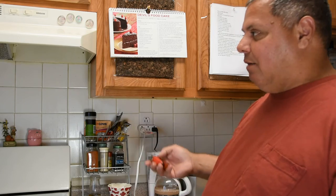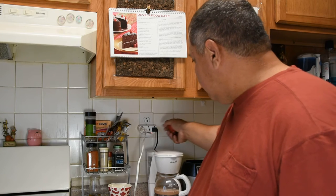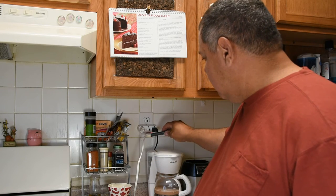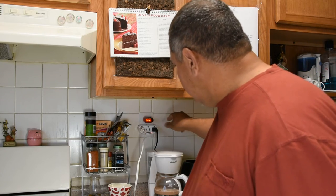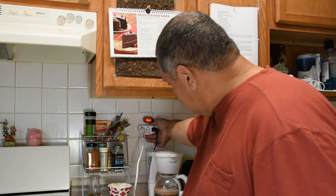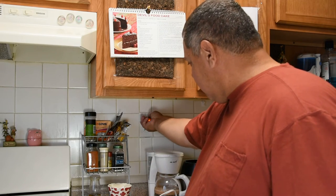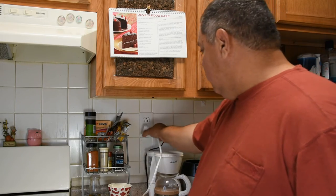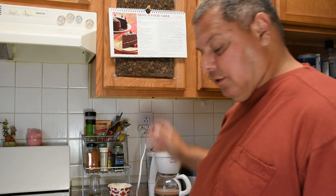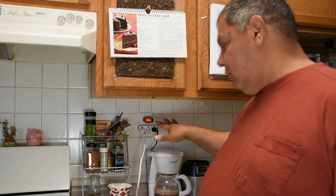You can buy these to test outlets and GFCIs. I'm not sure if it will trip a regular breaker — let me test that now. The outlet is hot. Let's see if we can trip the breaker on this line. Nope, it doesn't trip the breaker. So it will trip the GFCI but not the breaker on this outlet's circuit — not necessarily a bad thing. You can see the two yellow lights lit up, telling me this outlet is actually wired correctly.